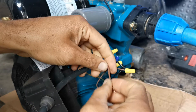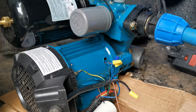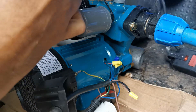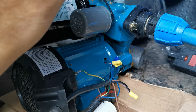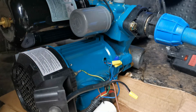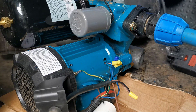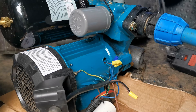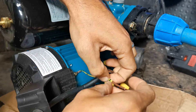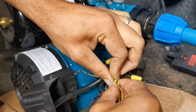So this is our earth. What we're going to do is take some earth-coloured electrical tape and just wrap it around it, just to help the guy after us — because the guy after us is likely to be us. Just to let everyone know that that is not a live wire, it's actually an earth bizarrely. Doesn't need to be earthed I suppose, just wrap that around in some fashion — as long as they get the gist.